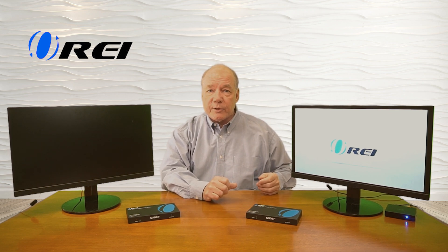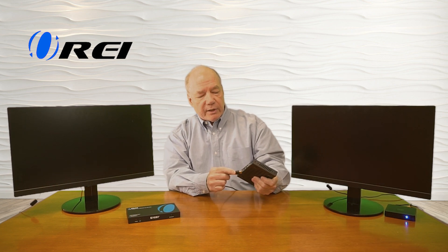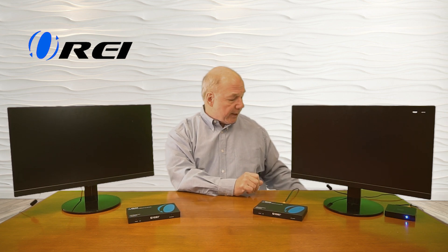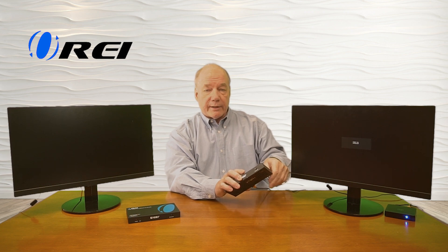The first set of connections I'll make are to the transmitter module. I'll start by disconnecting the media player from the monitor — it's a standard HDMI connection — and I'll plug that into the HDMI input port on the back of the transmitter. Now I'm ready to add power. I've already plugged the power supply in, and I'll plug the barrel connection with the locking collar into the DC input port on the transmitter and tighten the collar. The transmitter immediately starts an internal power-on self-test, checking all electronics and also checking the resolution of the media player to make whatever adjustments are needed to send the best possible picture and audio to the remote location.